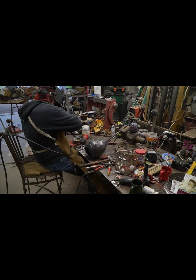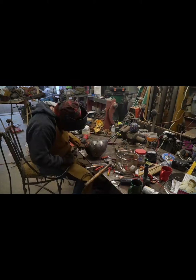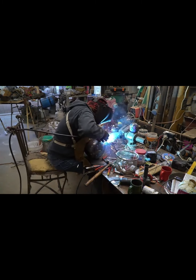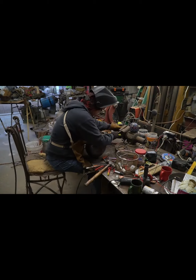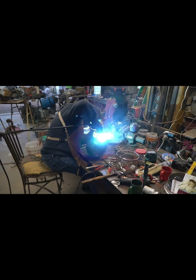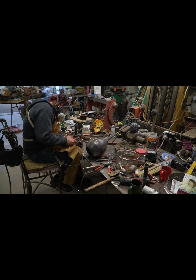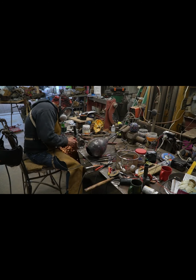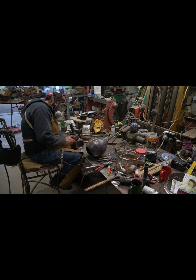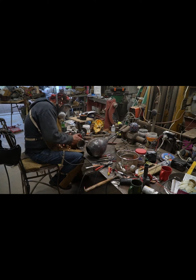Here I've got a 4-inch weldment bung for high pressure pipe, and I'm going to use a brass clean out from plumbing to seal it, but it's way too deep because eventually after my father passes, he's cremated, my mother and father want to be combined together and then spread somewhere. So instead of having a giant bung sticking through trying to keep most ashes from coming out, I'm slicing it down just slightly deeper than I need. Make sure you check which end is threaded first on the pipe threads, that way you don't stick the wrong end in and have to cut it back out.